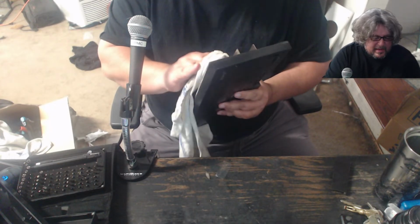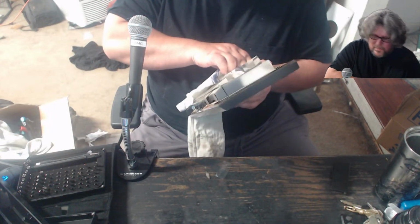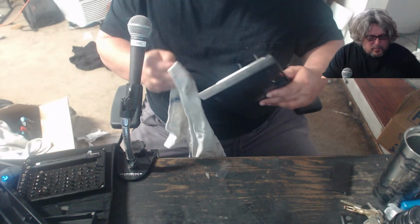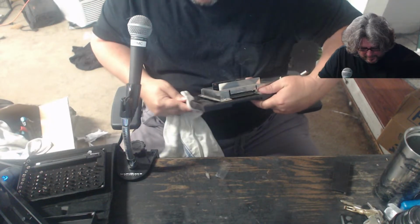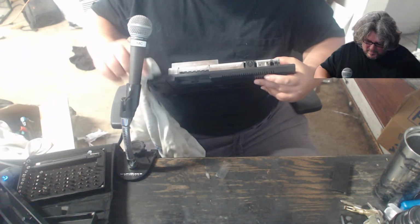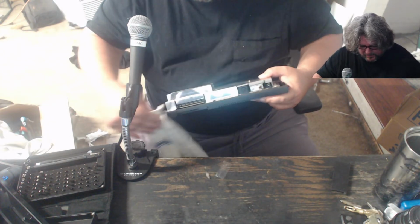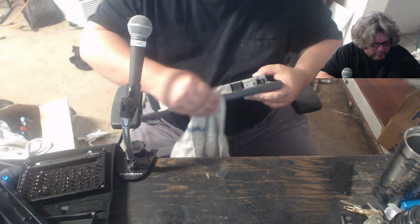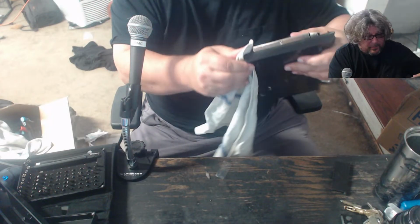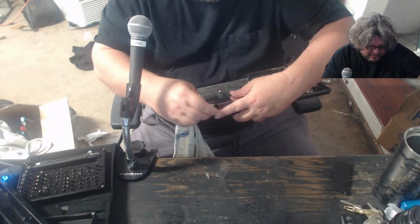It's funny in this day and age, they don't even bother with RF shields on so much stuff. Like you look at our desktop computers, which are running in the megahertz and gigahertz. The megahertz is like your typical VHF broadcast frequencies, and then your gigahertz is your typical microwave frequencies. We don't put RF shielding on any of that stuff anymore.